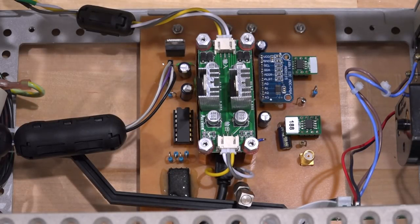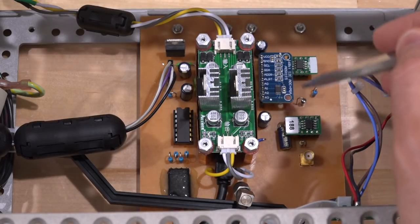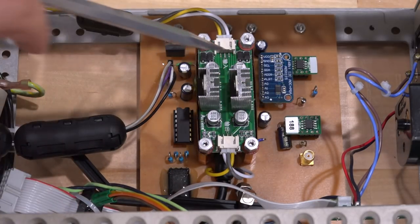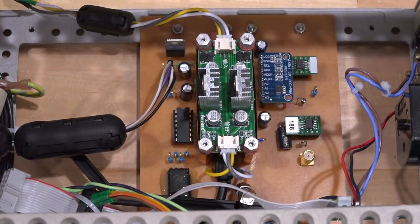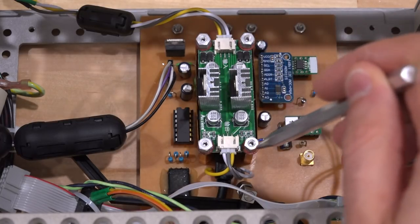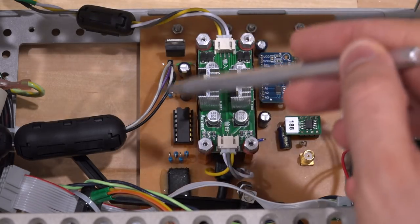Here I'm retrofitting the PCB directly inside the unit. The dual regulator is at the top where power supply comes in. Here's the A2D converter, the two op-amps that recondition the signal from negative to positive with a gain of two, decoupling capacitors, and protection resistors. Underneath this PCB — mounted on a standoff — is the Arduino-compatible processor, with the USB port going right underneath. I've put copper tape all around the standoffs to create a Faraday cage, so the top, bottom, and sides all have ground, confining the noise generated by the microprocessor.